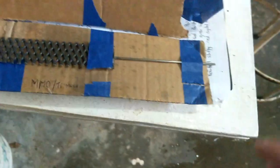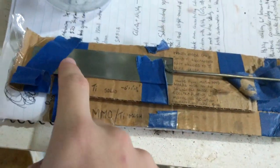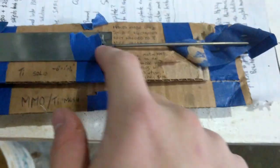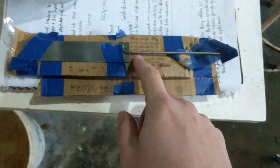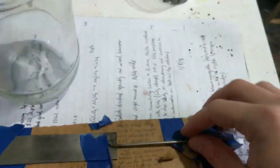The most important part of a chlorate cell are the electrodes, and I happen to be lucky enough to have got some beautiful electrodes off a Science Madness member. These are titanium and MMO — basically the best you can get for a chlorate cell. Maybe platinum is slightly better, but this is a titanium strip and he's spot welded titanium poles onto the electrode, which is not an easy feat. I believe he did it with a microwave oven transformer.